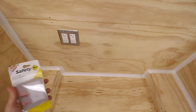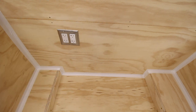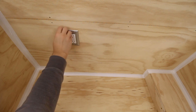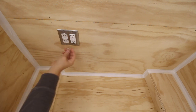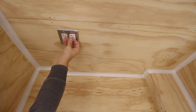I also got some child-proof outlet covers to go in the outlets that aren't in use by the saw. I didn't anticipate it when laying out the outlets in my shop, but this series of outlets lands right inside the dustbox, around the level where the miter saw is throwing dust back. They are tamper-resistant outlets, so they already have an internal mechanism to prevent unwanted insertions, but I figured it was best to protect them from excess dust regardless.